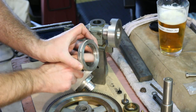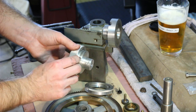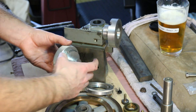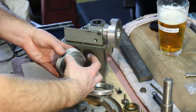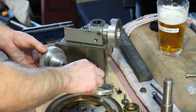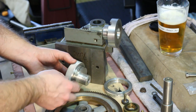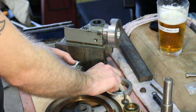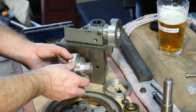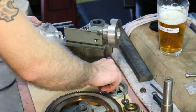You can see I've got a ring groove machined around the inside to fit against this spring-loaded ball bearing here to act as a detent. It keeps it located and pulled up against this face of the handwheel. So if you've ever wondered about making a zeroing handwheel with a collar like this, this is probably one of the simpler ways to do it. There's a little spring and ball down here so they don't get lost.